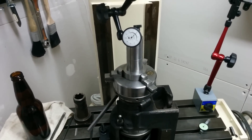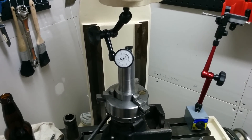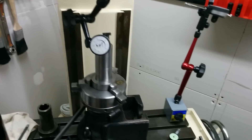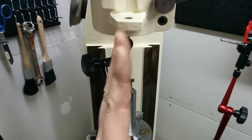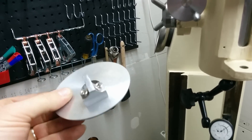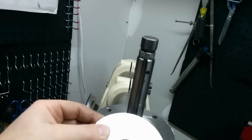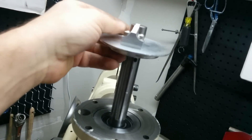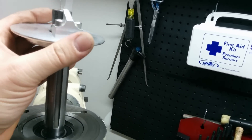I've got everything set up. Now I'm going to lock down the X axis and do my work off the Y. I'll get my cutter in there. One more process before cutting: there's this disc with a big shoulder and a little key that sits in the spline. What ends up happening is this slips down onto the spline and sits on top of the head just like that, and I'm going to clamp that down into position. That's my tool orientation lock.